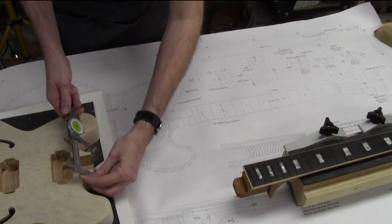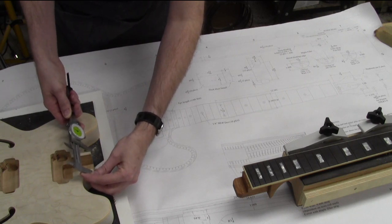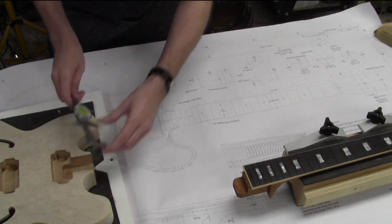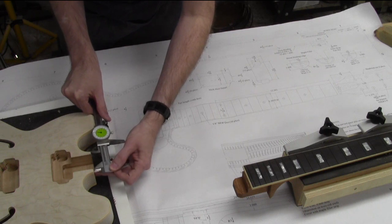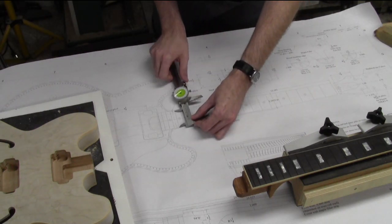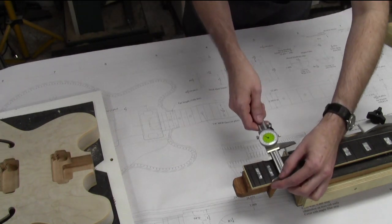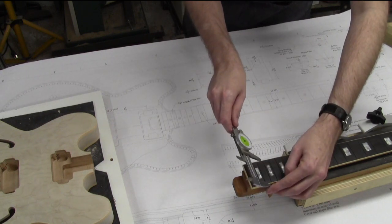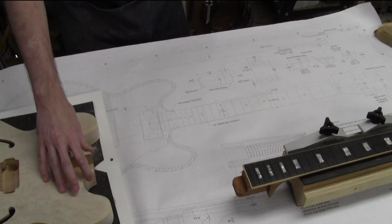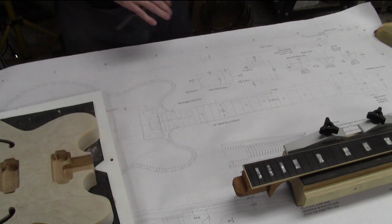This should be two and an eighth or so according to the plans. We are at very near it - a little thin. We're a sixteenth shy, so that's where things deviated a little bit. We're at two and a sixteenth. So we've lost a thirty-second on either side just from that. These are full scale plans, so I took a quick reading right at the bout - and we're actually perfect right there. So my neck fretboard shape is according to plan, but when I did the body I must have gotten just a little skinny here when I should have been just a little wider. I'm skinny by a sixteenth right there - so we at least know the source of the issue.